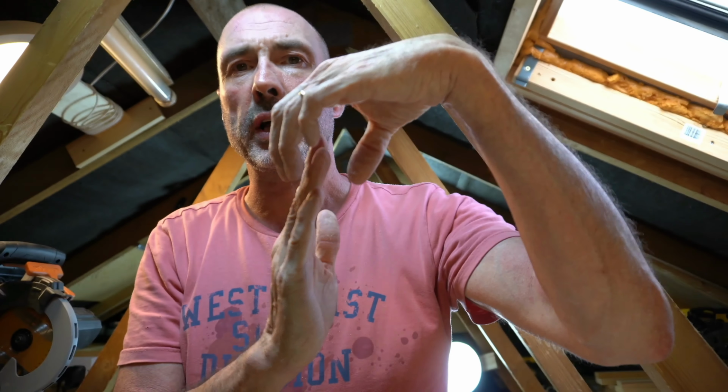Okay, so that's the tongue and groove pushed through the saw. Decided to use a bandsaw for a change. First of all, it's a little bit quieter than the circular saw, and secondly, it just doesn't create as much dust. So I've cut the tongue and groove in a way that the tongue is sat up and the groove is sat down. That way any rainwater or moisture doesn't actually just sit in the groove, it is forced to run away. If I'd done it the other way, then the water would have sat in the groove.